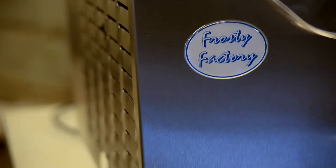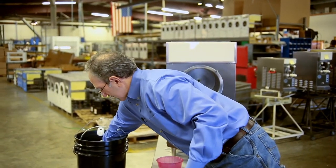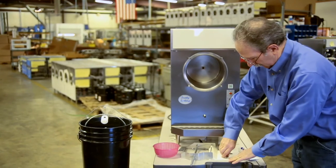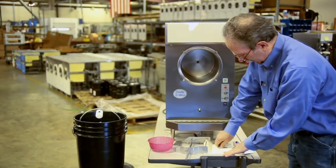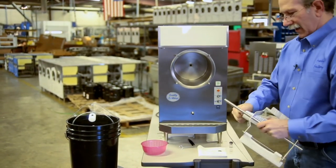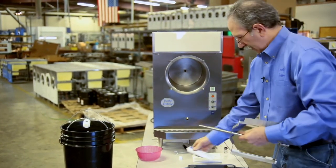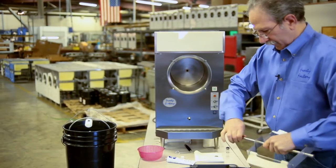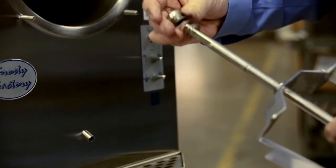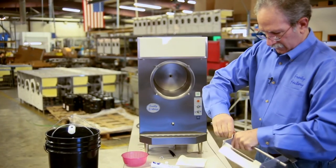When reassembling, take your beater bar and your spring seal — these two pieces have to be very clean. Spin the seal to get all the grease off, then put a light film of sanitary lubricant on the bar, just enough to help you slide the seal onto the bar. The cup goes on first, then the spring, and then the black carbon ring goes on last.